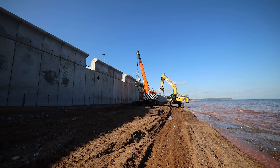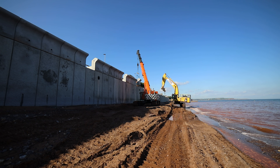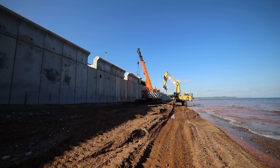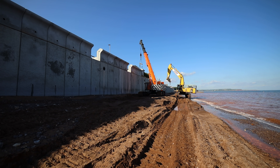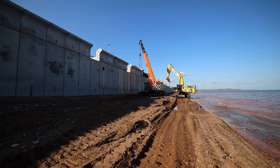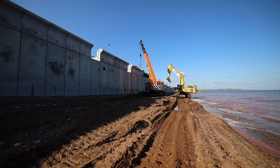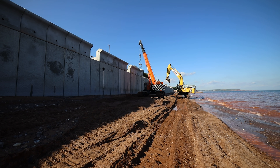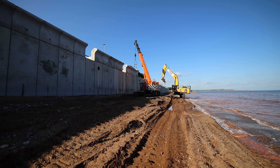This is the last one of the day — that's unit eight for today. The units are being delivered to Timberthrood Road like the rest of the precast and they're coming over from Ireland, either two or three at a time on each wagon. They get offloaded up there and then get loaded onto our specially modified trailer, which fits underneath the colonnade underpass, and then we offload them with the 70-tonne excavator, which then feeds them to the 70-tonne crane sat on the steel mats — very similar to the facing panel temporary works arrangements.